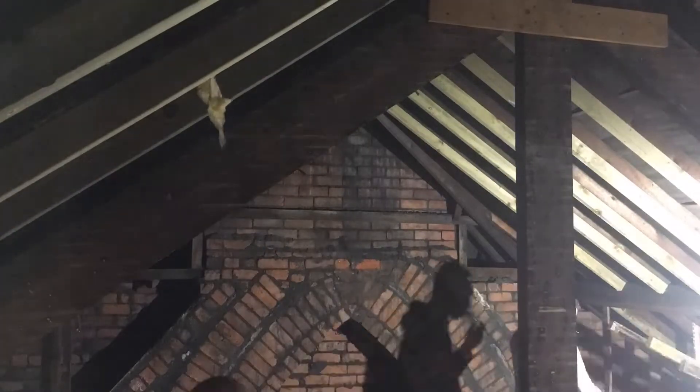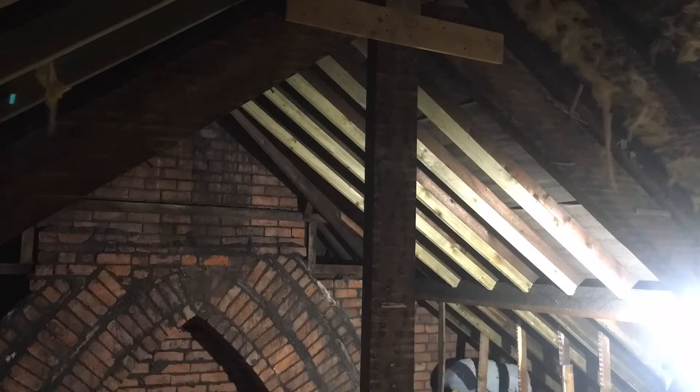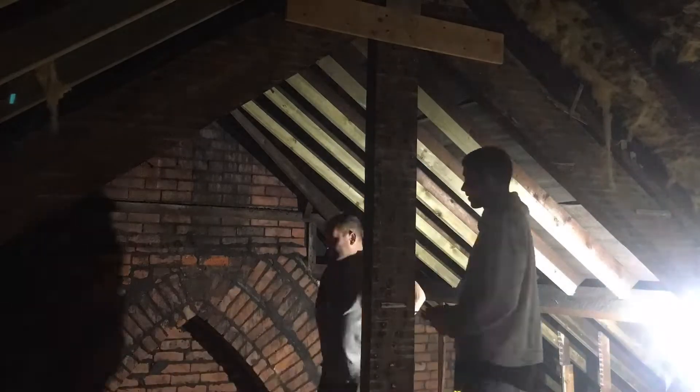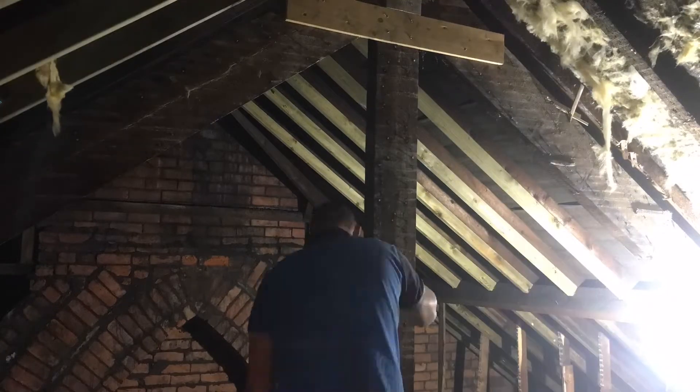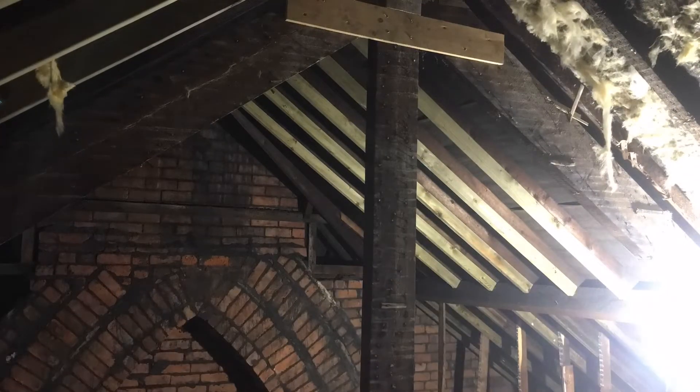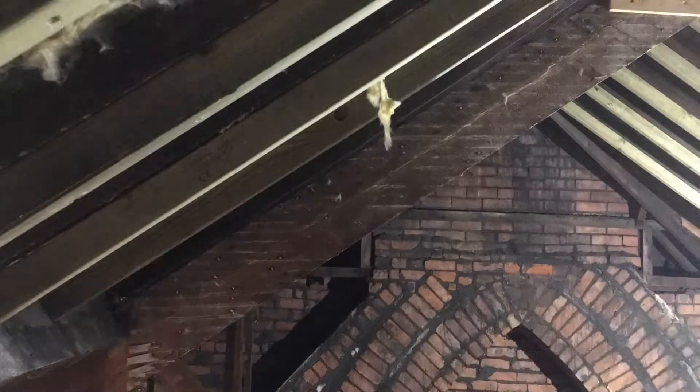I've got help — Luke — and we're starting to put rafters in. In this section of video I'm putting a structural beam in on the left-hand side, just out of shot. What Luke's doing is doubling up the rafters to reinforce them. Rafters are the beams in your roof structure, and you can see the new pieces of timber because they look really shiny.